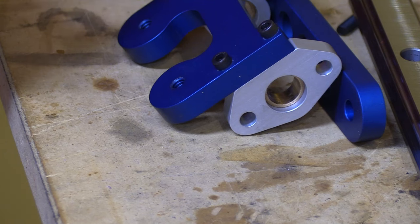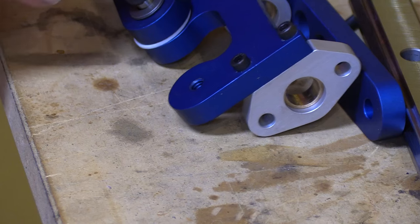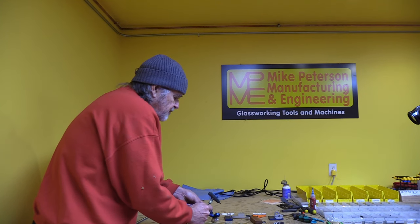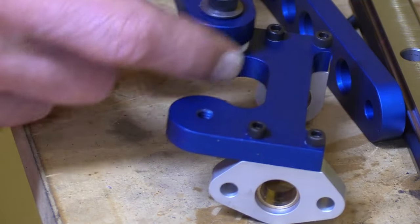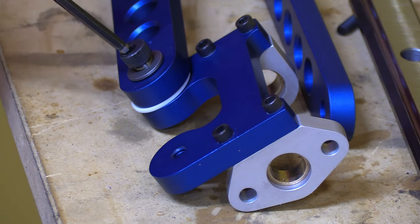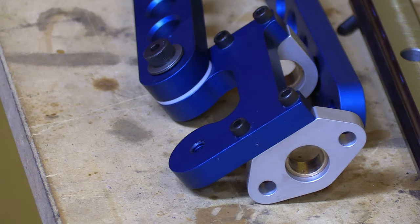The pair of Belleville washers goes on the shoulder screw first, then the arm, then the Teflon washer, and then you screw it all together. It is very easy to pinch that washer because it's flopping around a bit. You need to nudge the washer around with your finger, and as you're tightening the screw and nudging the washer, it should be fairly easy to feel when the washer is centered and not pinched.